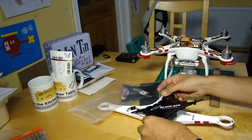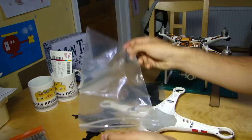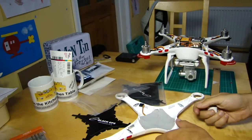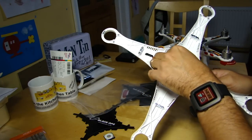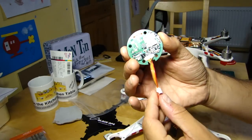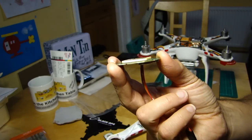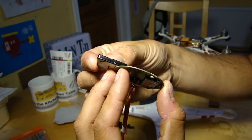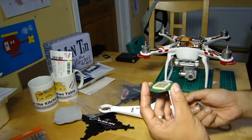This was particularly useful if you didn't have the very latest V3 version where DJI had beefed up the shielding, because they knew there was a problem. But they've now sent me their Black Ops version - a new updated version - which has a rather interesting addition. As well as a beefier shield which sits into these slots here underneath the tabs, the pack also comes with an upgraded GPS antenna. Here's the GPS receiver board - and that on the back is the antenna that receives the GPS signals. If I compare the old one with this one, you can see it's about twice as thick - this is a 4mm and the original is a 2mm.